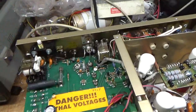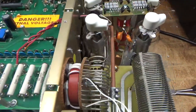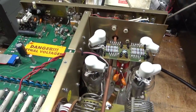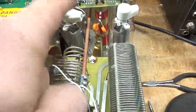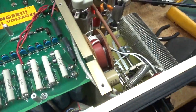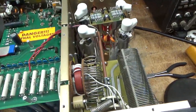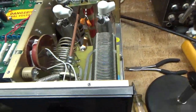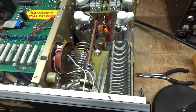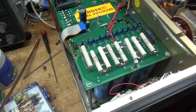Cleaned the output relay and TR relay. Cleaned the soft start relay contacts. Checked it on all bands — everything looks good. Replaced the LED for the transmit indicator. Replaced that phenolic shaft — the old one was super warped from a tube getting really hot, with the new Pentalab tubes. Also changed the meter protection diode. Thanks for watching — if you need any amplifier repaired, please feel free to give me a call.